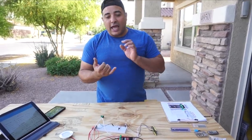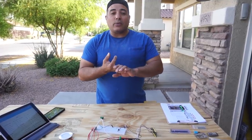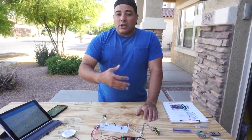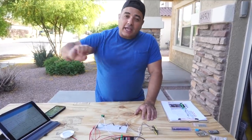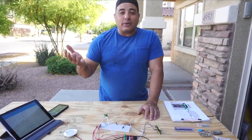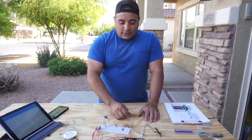So now you have to have your MQTT server up, you have to have Home Assistant up and running, and you have to have a network up and running. For this, the processor just needs to be running. So the processor will go ahead and turn those lights on, and then it will tell Home Assistant, hey, the lights are on. If Home Assistant isn't up and isn't available, the lights are still on and off with the switch. And so that was our next challenge, was how are we going to do the switches?